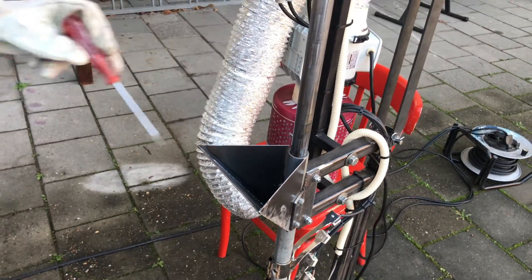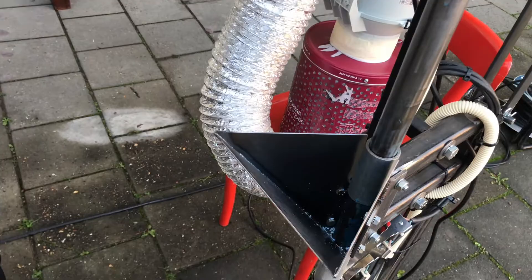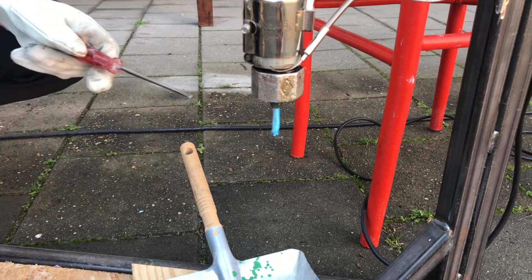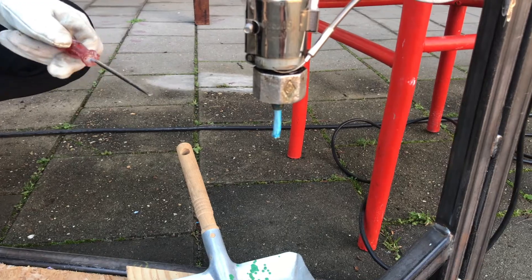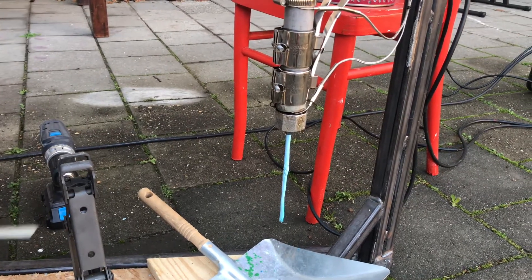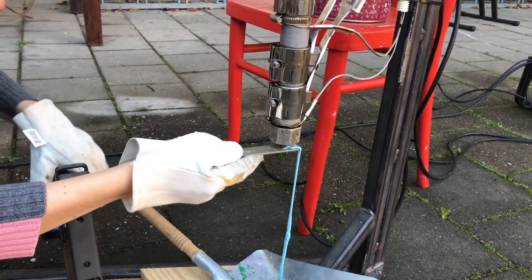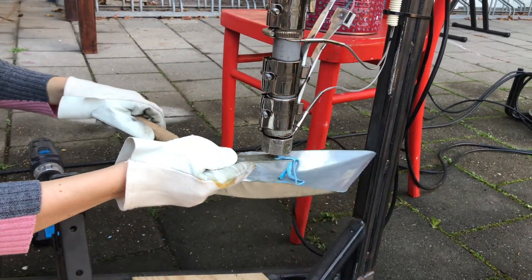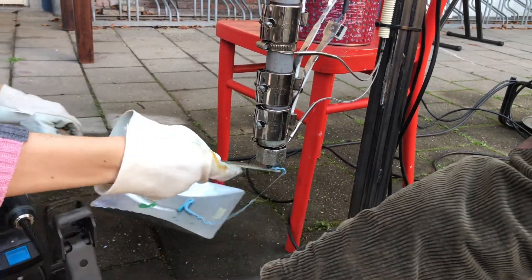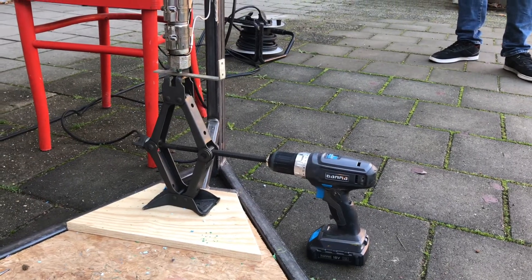When all the plastic has disappeared from the hopper we have to wait for a bit for the plastic to melt. When you see a little bit of plastic dripping out of the nozzle it's time to take the next action. First we have to do a little test pressing — press out the rest of the residues from last time. If you see that the plastic coming out is a toothpaste-like consistency, we will clamp a metal strip under the nozzle so that nothing more will come out.